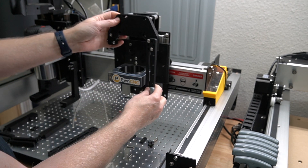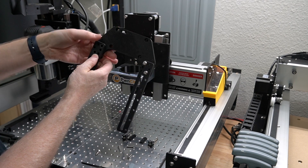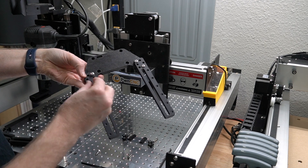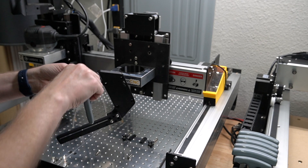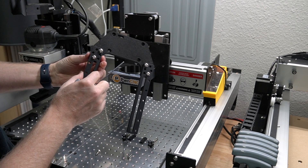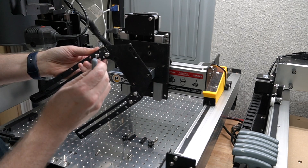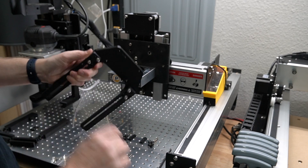Let's jump in and put the other track on. On this side the holes are on the outside, and on this one we're going to use the upper right hole which goes through to the backside locking nut, and on this side the bottom left. I'll give you a better view here in a second. Get these started so they don't fall out. Now I'll hold this in place, keep it flush between my fingers, and make some adjustments before putting it down to final torque.